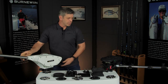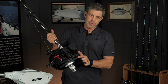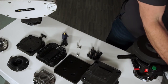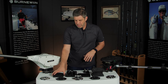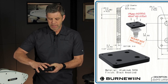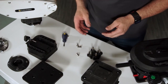In Scotty's case, even without the swivel base you need to use the adapter plate, because their downriggers all mount on their flip-up base. So to mount a Scotty downrigger you've got to use our adapter plate and either their tilt-up base or their swivel base. The one downside of running downriggers like this that some people don't like is that they have to lift it a little, clear the spline, and they feel like on the water that might be a little dangerous. So if you want to use a swivel base, with the Cannon you would put the Cannon adapter plate on the UM6080 and the dovetail base goes on their swivel. In Scotty's case, you would put the Scotty adapter plate on the UM6080 and the swivel base on the adapter plate with Scotty's factory setup.